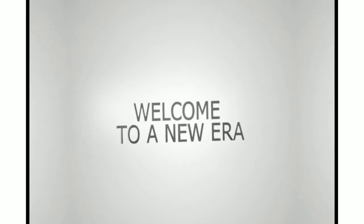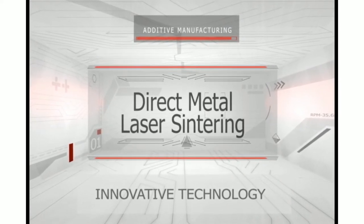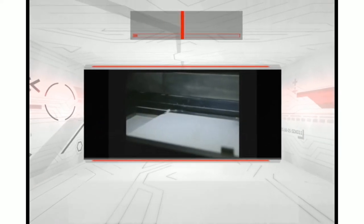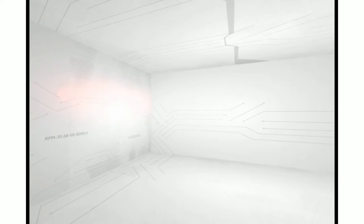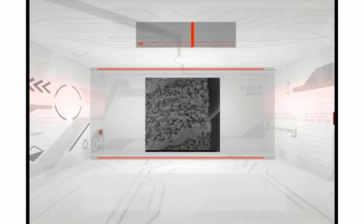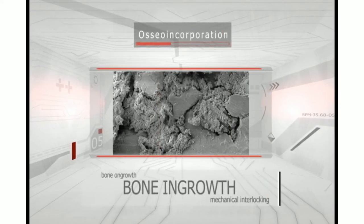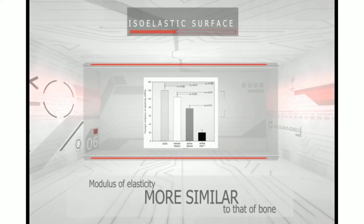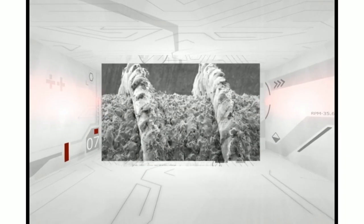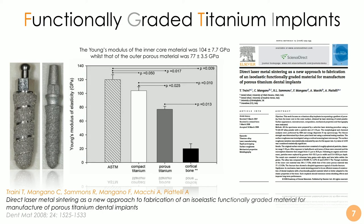In this short video, we welcome digital dentists into a new era — the era of direct metal laser sintering, an innovative additive manufacturing technology used to fabricate dental implants. A focused laser beam melts titanium powder layer by layer. The scanning electron microscopy shows a porous surface with an open interconnected structure of pores and cavities, several concavities on the outside that allow incorporation — not only bone on-growth, but also bone in-growth, granting mechanical interlocking and an iso-elastic surface more similar to that of bone.